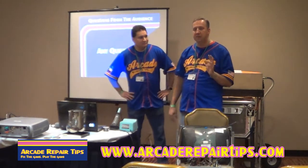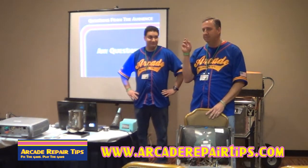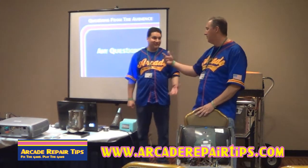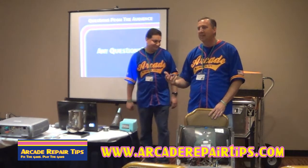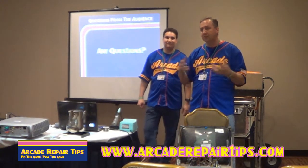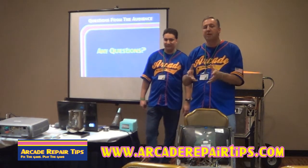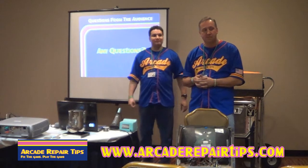I used to say, I put switchers in everything. If you heard me five or six years ago, I'd be like, oh, your Defender's not working? Put a switcher in it and get the kit. But I'm talking to Ken Graham. The more I listen to him, the more I understand that they're good in most of your newer Japanese games. I would say they're great. But if you can fix a linear power supply like in a Defender, they're just better. They're better designed for that game. The hardware is made for that voltage that the Williams power supply puts out.